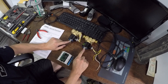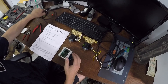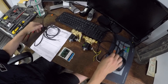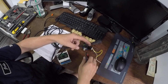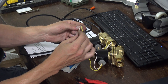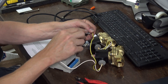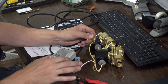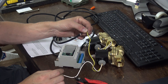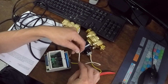These are 110 AC solenoids, so you either need to get an electrician's help or be confident that you're doing this in a safe manner — both for your own health and the health of the machine. With power cables, I'd suggest the link in the video description. So let's strip the end off one. The solenoid needs 110 volts AC. If we connect the white to the white and the yellow to the black — or vice versa with AC, it doesn't matter — this solenoid will turn on and turn off. What you do is connect two of them together permanently with a wire nut, and then put the black and the yellow into these blue terminal blocks.